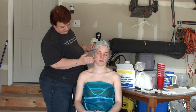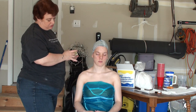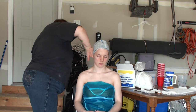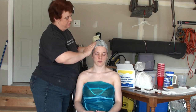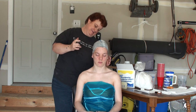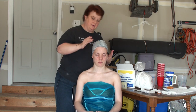The releasing agent. You can either use Vaseline or KY jelly or hair conditioner cream. Not hair conditioner, but hair conditioner cream. And this will help keep the alginate from sticking to her hair and removing it. Also helps with certain curves. Now her form's going to have some ripples in the head from the cap. We could just sand that down later on in the stone positive though.